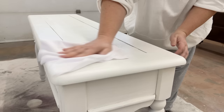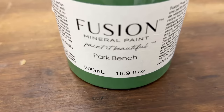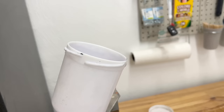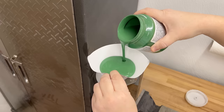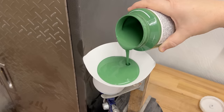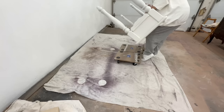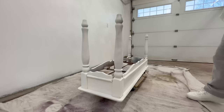Now we get to the fun part. I'm going to paint this table in Brilliant Park Bench Green by Fusion Mineral Paint — it literally is a park bench, grass green, quirky splash of color. I'm spraying it using my gravity-fed HVLP pneumatic gun to get a clean, smooth finish, but if spraying isn't your thing or you don't have the space or equipment, you can absolutely get a great finish with a good brush or roller. To avoid any paint boogers or clumps of pigment, I poured about half of this pint through a paper paint strainer and added about a tablespoon of water to thin it down just slightly. Spraying does use more paint than brushing, but this half pint will be more than enough to do three coats on this table. I flipped the table upside down again to get around the legs and sprayed on my first coat.